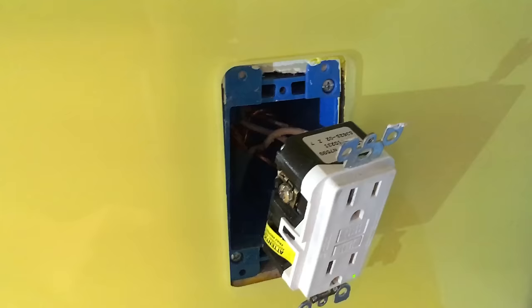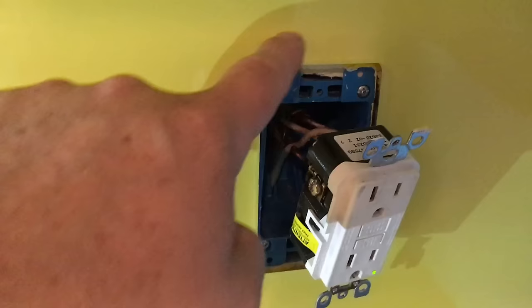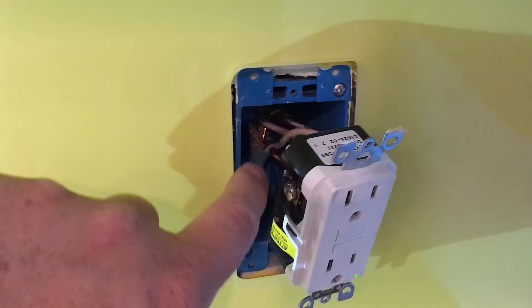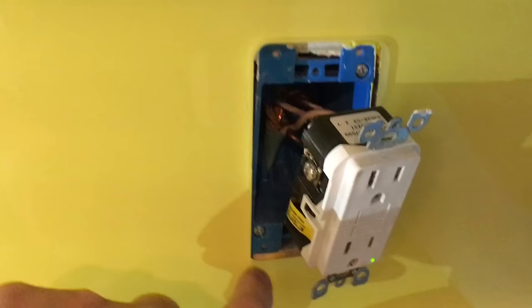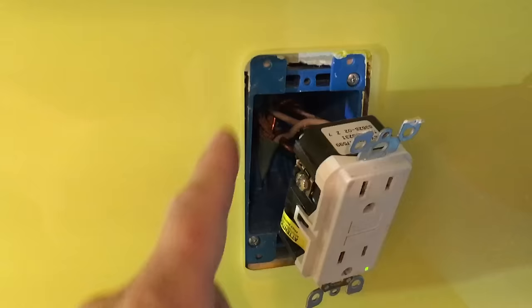And you're going to want to have the much larger style of cover if you just get the white or the black or the gray covers that go around here, because obviously this is going to be cut a little bit larger than your original outlet box, and you're going to want a cover that goes out far enough that you don't see any rough edges or weird painted pieces right on the edge of the glass there. So get a little bit bigger cover and it'll cover up nicely.